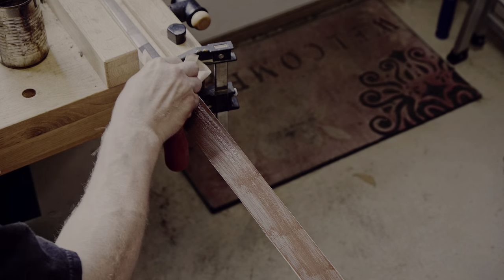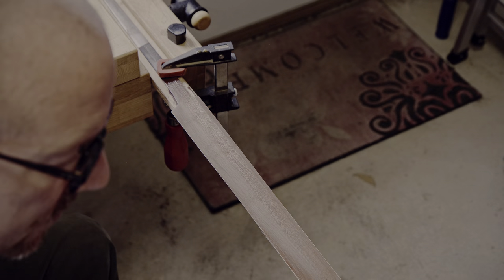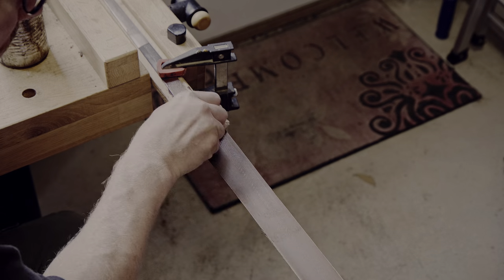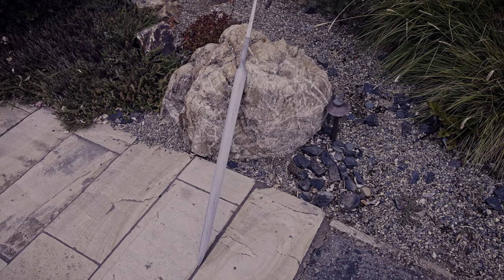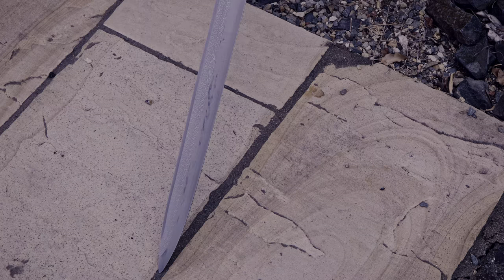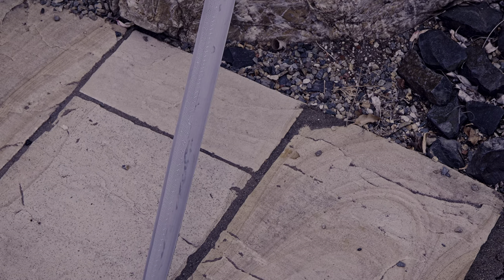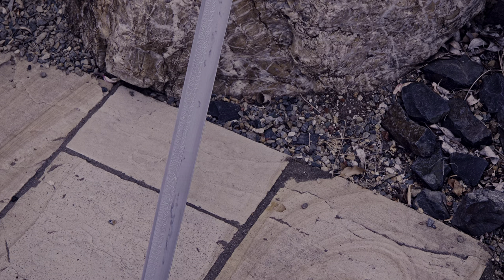In this video I'm only showing one side of the blade. Usually I would switch over to the other side while still being at the same stage of polish. Here is the whole blade after polishing. Blade photography is quite challenging — I was waiting for a cloudy moment so that the sky had roughly the same brightness and illumination. The close-up shows some pretty activity in the steel. The darker spots come from differential hardening where the shallow hardening steel did not quite react the same.